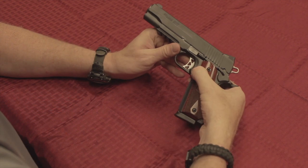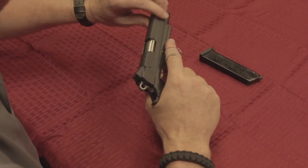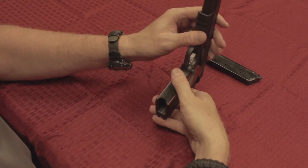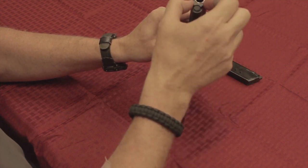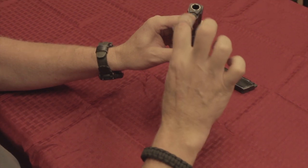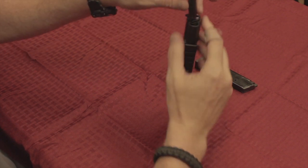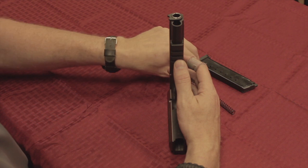To start with, magazine release button — kicks the magazine out really clean. Set the mag aside. Check it to show clear. It's important when you take a 1911 apart, you have to pull the hammer back, so I tend to do that when I check clear. Hammer back. With most 1911s, to get the guide rod out, you have to turn the bushing. There's a little wrench that comes with your 1911 — it takes an extra part. The nice thing about the SIG is it's not a full guide rod inside, just a tab there. You can actually do this without any tool — push this down and turn the bushing to the side. Make sure you don't just let go; it's spring loaded. You will shoot this into the nether regions of your room. Spring comes out.